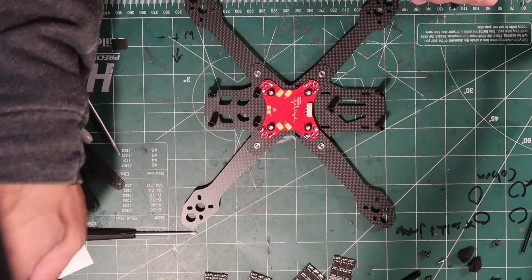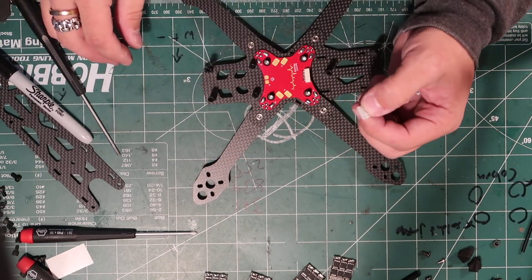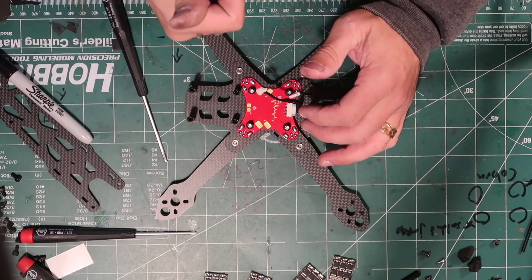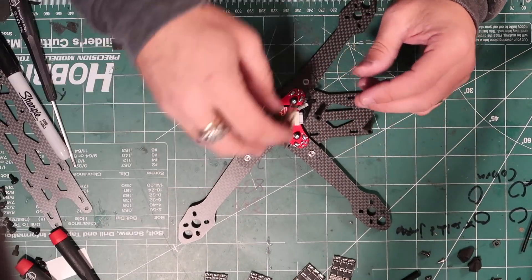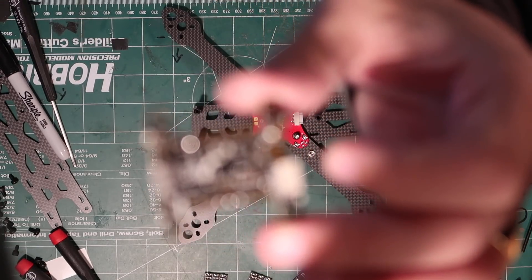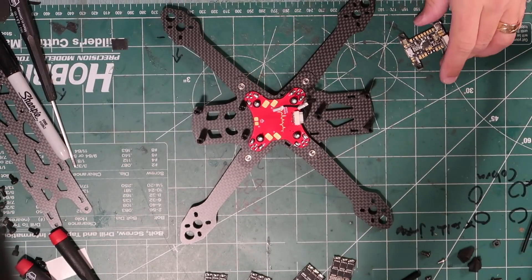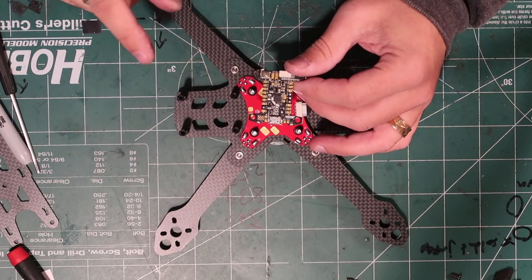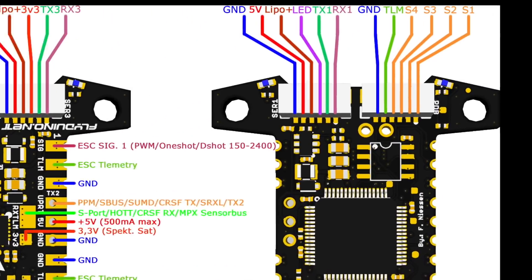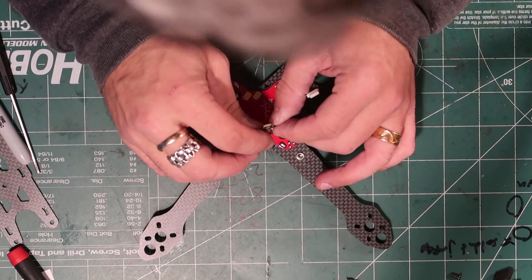We have this together. They give you a fantastic little wire that goes into the plug with a lock clip, which is great. One wire is for the ESCs, the other is power and ground. I'm going to use the KISS V2 flight controller on the Reverb. I'll put a link in the description for the pin layout, or I could just show it. It's pretty straightforward — it only goes in one way. If you plug it in the wrong way you probably shouldn't be in this hobby.